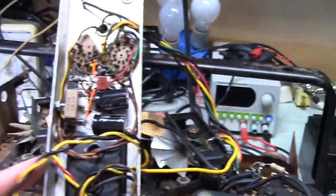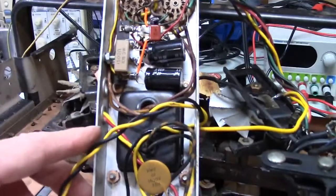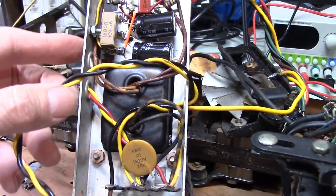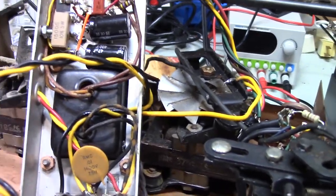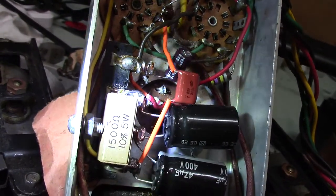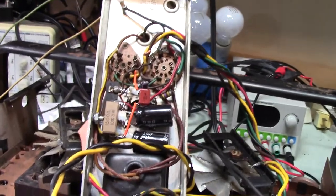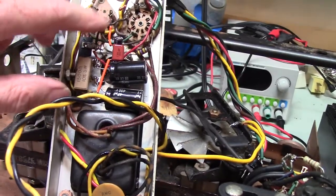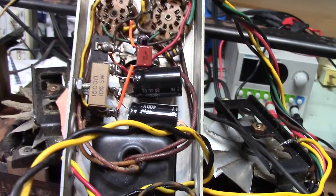So I said, well, I'll try it anyway. So I got my soldering iron out, and solder just beat it up and rolled off. I said, okay. So I put the terminal strip in. I clipped all of the connections off from the old capacitor, and then I rewired everything, like as you see it. Tried to do a decent, neat job. I think it did all right.